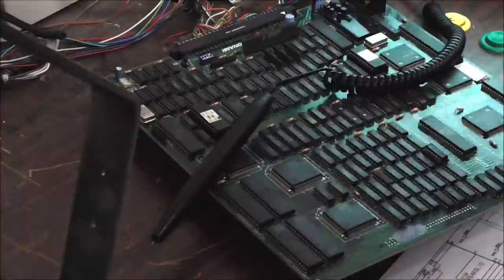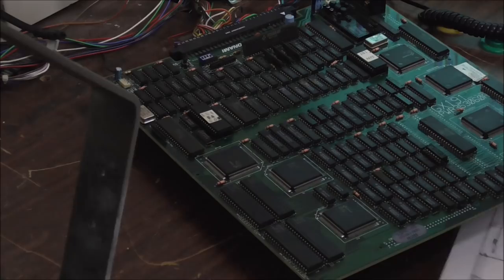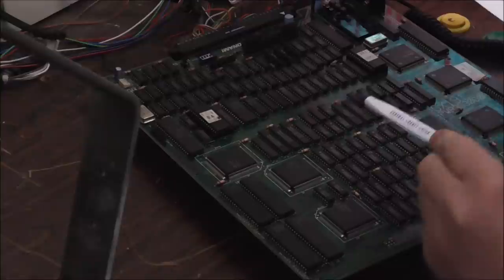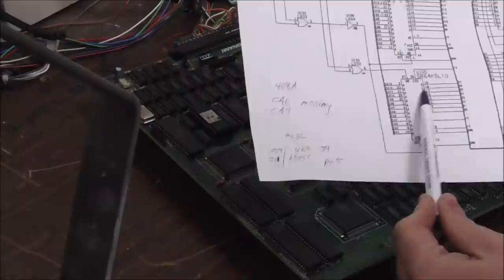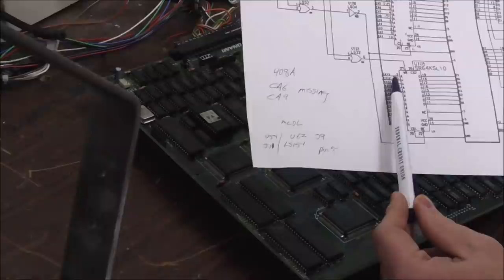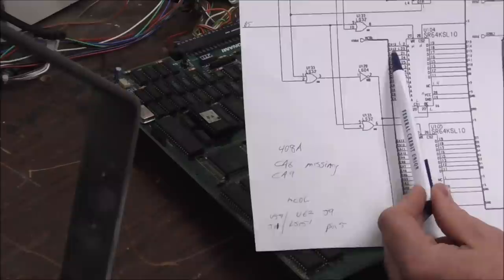So I'm going to show you what I'm doing here. I've got my logic probe hooked up. This board doesn't really have a good place to attach it that I can tell, so I had to put it on the power supply, which isn't optimal but it'll work. The logic probe is hooked up to the power supply, and I have printed out a little bit of the schematics. What I was finding earlier was it was telling me alternately that this chip or this chip — two RAM chips located here and here — were bad, and the game wouldn't even boot.